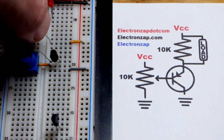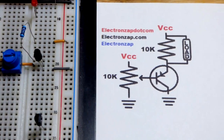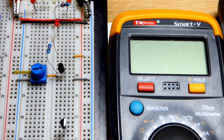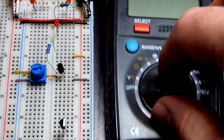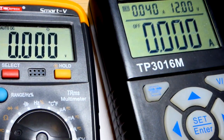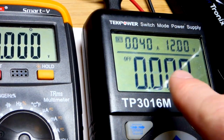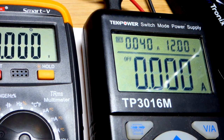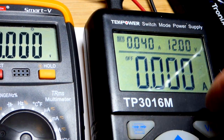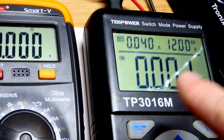We're going to get the multimeter before we add our load. Our load is just going to be an LED protected by a resistor. We got the multimeter ready — I can set it to measure voltage and turn it on. It's usually safe to measure voltage as long as you're not dealing with way too much. We have 12 volts at the supply. I hit the power button to set the output on, so now it's powering the board.